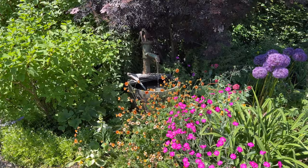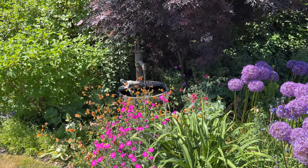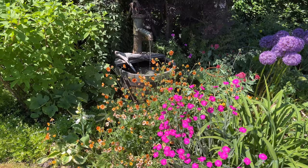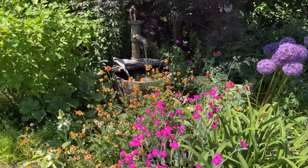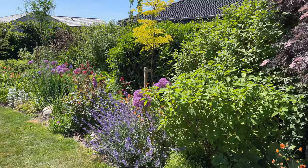Things I've got done since last time: I put in a foundation for this rather nice looking trough, since I think this will be its permanent location. It looks really good in there and that's definitely the place I want it. It wasn't level after the winter and I hadn't put in any kind of foundation. So what I've done is put in some gravel and sand, stamped it down really nicely beneath it, and hopefully that will secure it. I went down to about 70 centimeters, which should in most winters be totally frost-free.